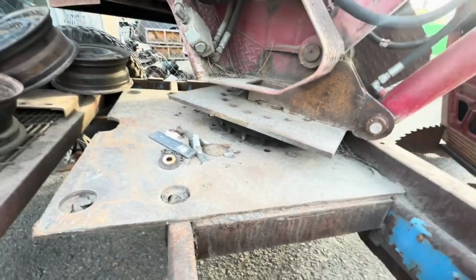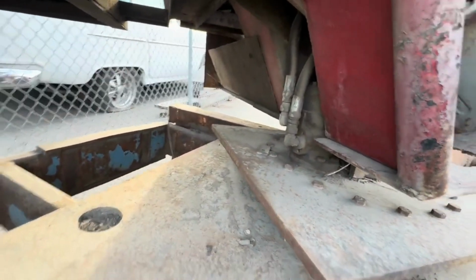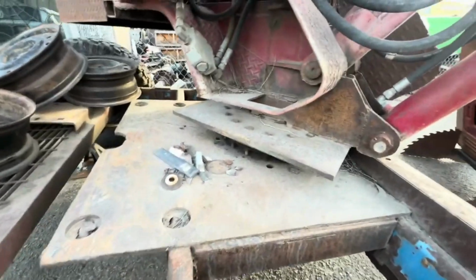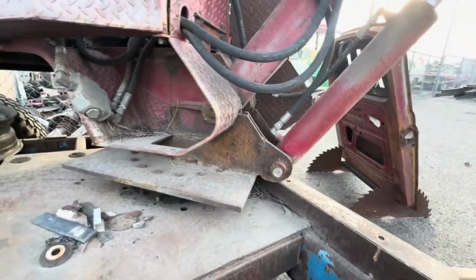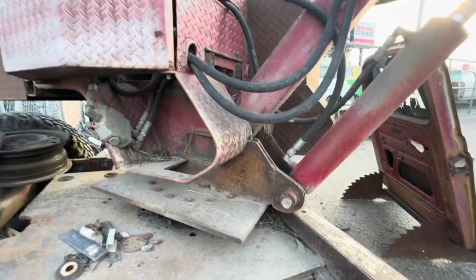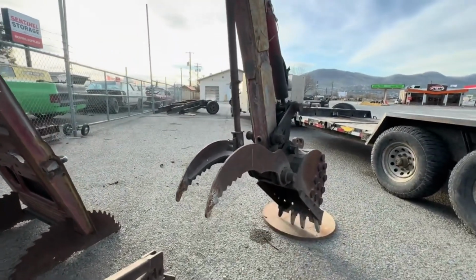So I was like, okay, perfect. And he also got the pump that's sitting right there that matches. So the gear on the end of the pump matches the Rotac bearing under there. Now, that one missing tooth, I decided, well, if I put it at the back, because you're always digging off of this end, it really won't be in contact. Actually, no, sorry, I put it in the front, pardon me. And so I'm working the back side of the gear and the one broken tooth is up front. It works perfect. This thing spins 360 degrees around and it's deadly. That upgrade was awesome. It gave me a lot more power to side load the bucket.